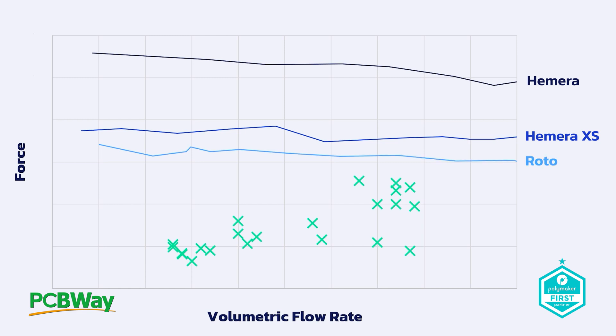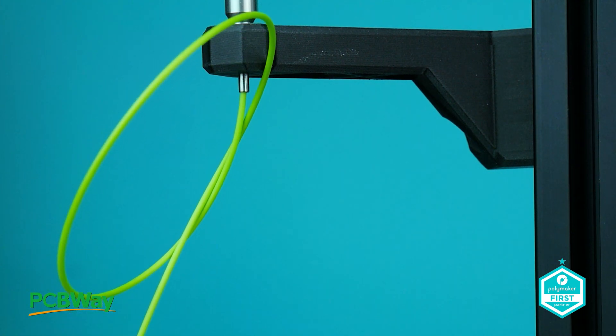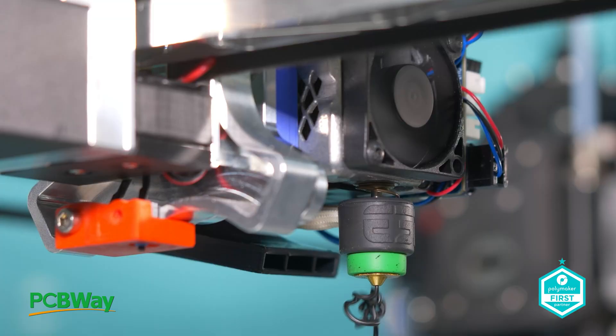This is the output curve for the Roto extruder. It has a high enough extrusion force output to print at the maximum usable flow rate for these nozzle, hotend, and material combinations, but it isn't carrying around unnecessary headroom. This has an added benefit: if the force were to rise above requirements — such as if there was a tangle in the filament spool — the extruder motor will stall. An optimized gear ratio shifts to a stalling failure mode rather than shearing the filament. While at E3D working with the tool changer, I asked them to show me this — it's easy to replicate by trying to extrude at a higher flow rate than your setup is capable of. The noise you can hear right now is the extruder motor stalling.